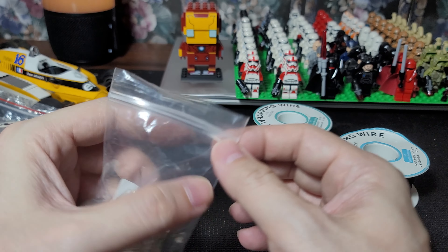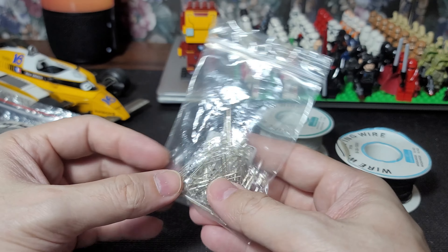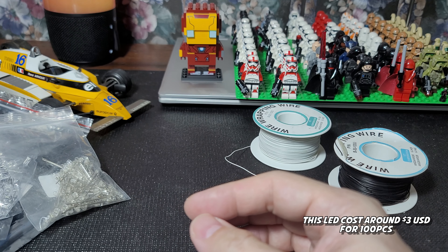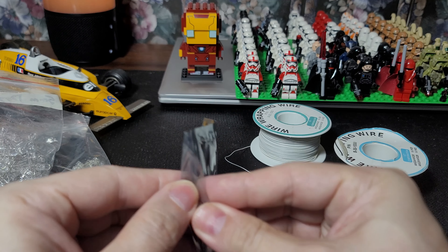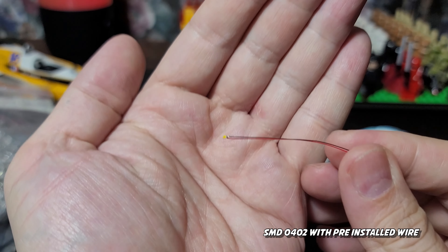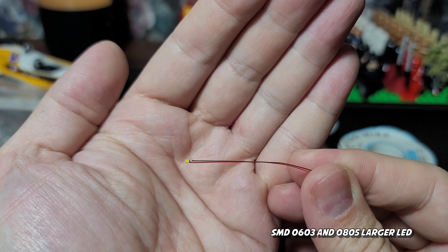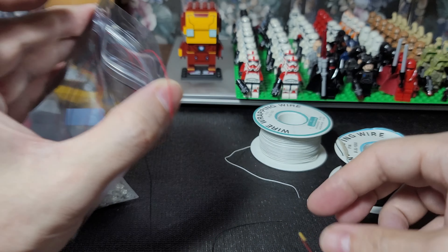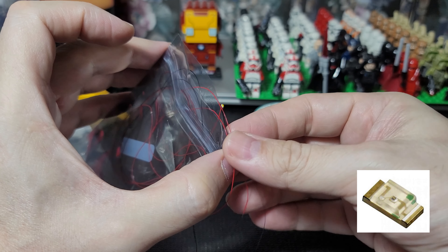In terms of sizes, there's basically 3mm and 5mm — those are the average LED lights you can purchase online. A bag of 100 LED diodes costs around a certain price — I'll just post it. There's also LEDs that are really tiny, like this one. They call this an SMD 0402, so it's really small. I think there's a 6 or 8 version of this one — I'll give the description below. They're all 3.2 volts or 3 volts to be exact, with different milliamps per LED, but in terms of brightness they're really good with the right voltage.